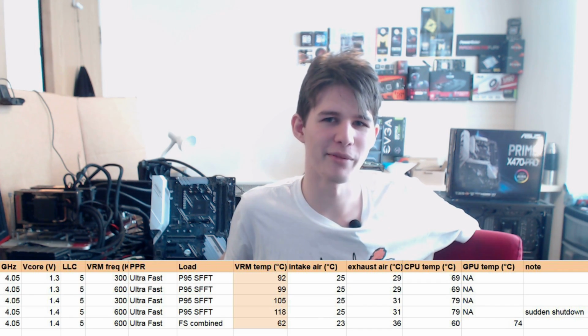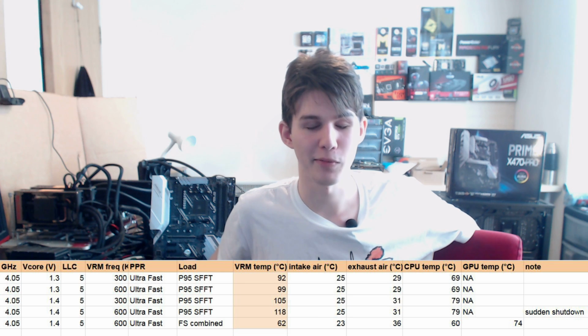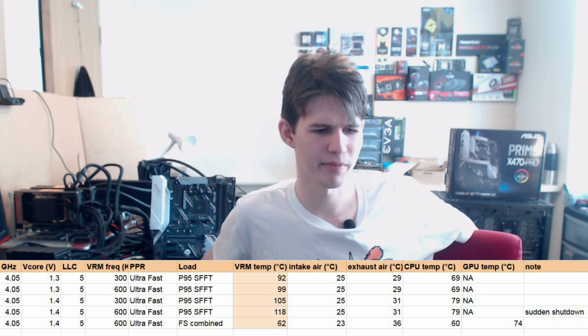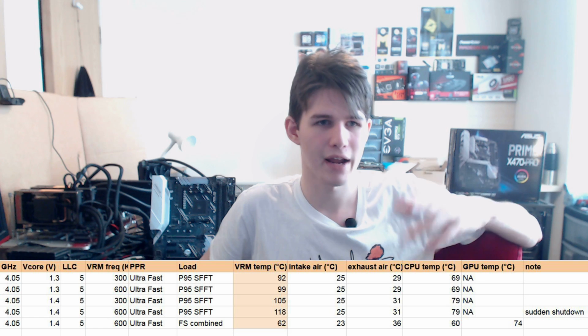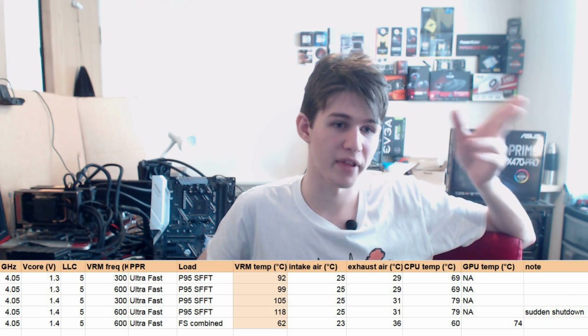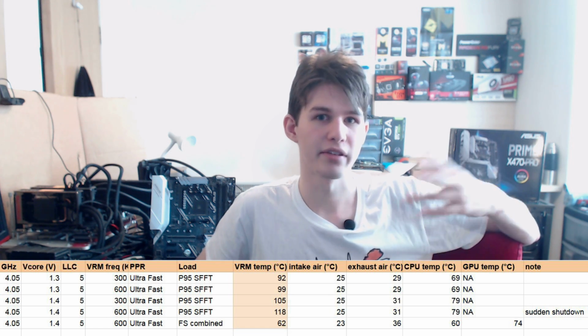But if you're just gaming on the motherboard, you won't have any issues. It's just, if you're doing a stress test to see if your overclock is stable, the board might randomly shut down on you, and it's because the VRM overheats. So basically, while you're stress testing, you'll have to do something about the VRM cooling, just for the period of time that you're doing your stress testing. And then after you're done stress testing, you can remove that, and you just have to hope that you don't run into any workload that overheats it.